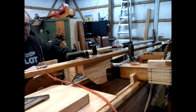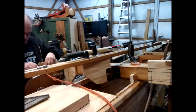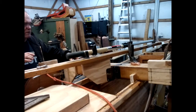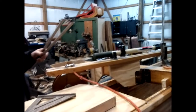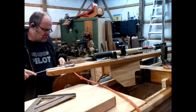So what I'm going to do, I have some stainless here. I am going to weld up some gudgeons to go on here with a hole in it. And as far as the pintles, they will just go on the board, and a couple pieces of this strapping. You can't see that. And the pintles are the part that go on the cross beam or the tie rod.